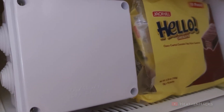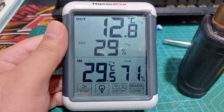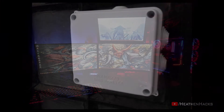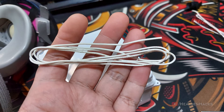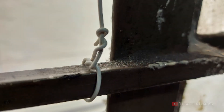This is what it would look like from underneath. Just to make sure the neodymium magnets don't interfere with the signal, I placed the junction box with the remote sensor inside our freezer. As you can see, there are no signaling issues — despite being inside the junction box and inside the freezer, it still transmits data. I've now placed the remote sensor outside the window — this is what it looks like inside. I know it's dirty, but it's hidden under the blackout curtain so it doesn't matter much. This is what it looks like outside. I can't reach it to clean it properly because we're on the second floor. All I need to do now is add the safety string — I used some solid core hookup wire I had lying around, tied it up to one of the railings, and it's done.